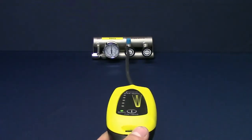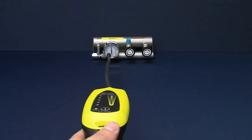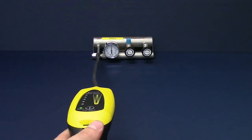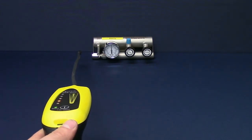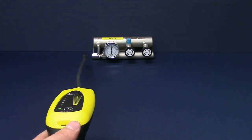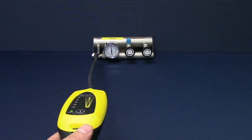When you're ready to check for leaks, begin by moving the probe slowly around a suspected leak. GasMate will beep faster the closer it is to the leak until a continuous beep is heard. Move the probe away from the suspected leak for a few moments and repeat to verify the leak.